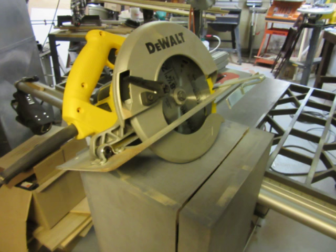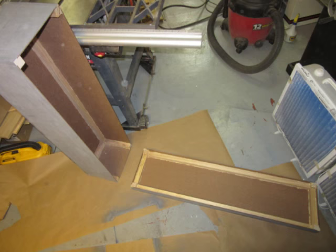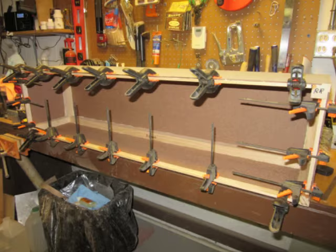One thing to keep in mind, though, is you don't want to make the lid any shallower than the stringer and whatever valance is going to be used to keep the long edges locked together when the case is closed. So keep in mind those dimensions and don't cut it any shorter than that, or there'll be a lot of difficulty.